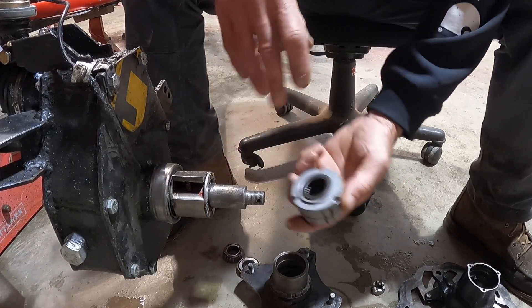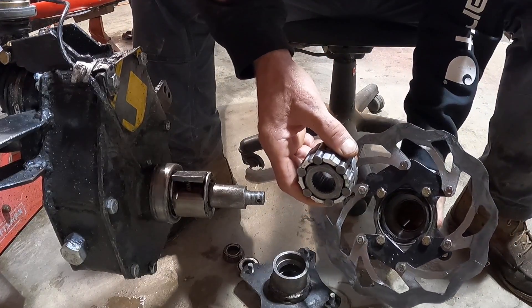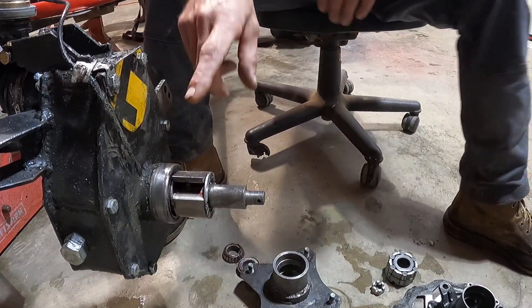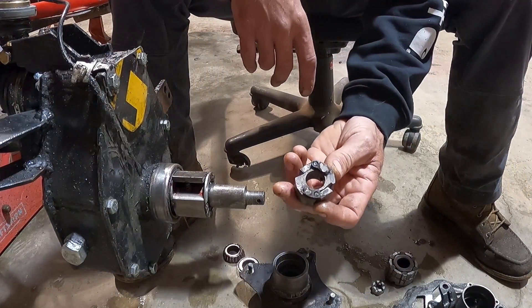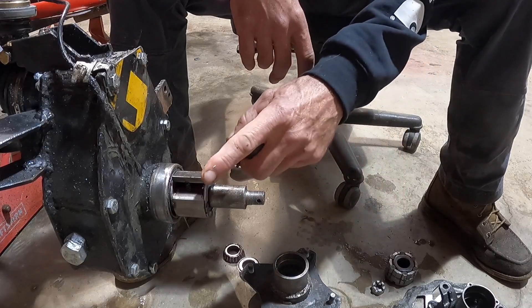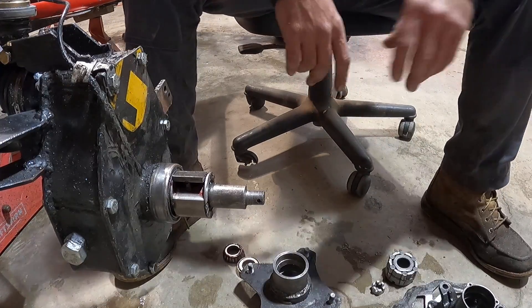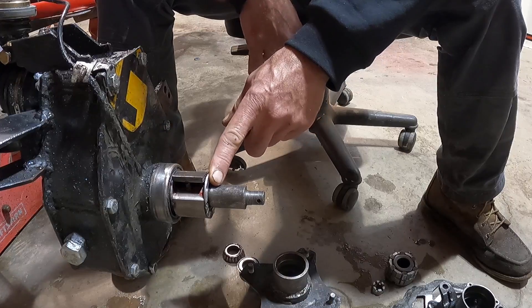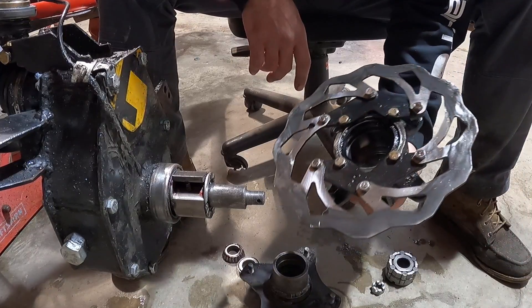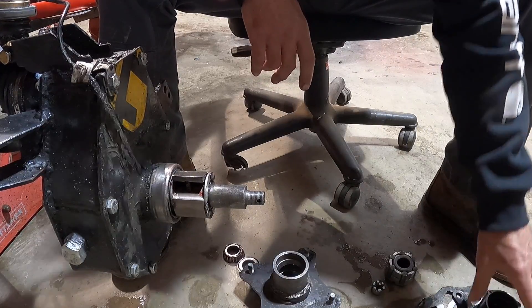The side-by-side Razors use Hilliard clutches, but their hub has ridges and valleys so the barrels can go up and lock into a pocket for a more positive engagement — that's what I'm hoping this is going to do. I also have this other little ratchet I made for the recon cart; that's an 8-horsepower engine powering that ratchet. This is going to be a 50-horsepower KTM engine, so it's quite a bit bigger. With the Hilliard clutch you have an oil bath, which sounds nice until your oil starts leaking onto your disc brakes and you don't have any brakes — that's what happened to me on the Rubicon.